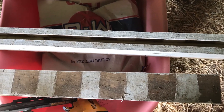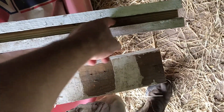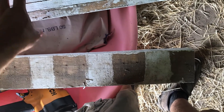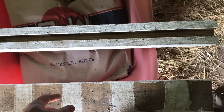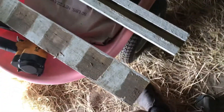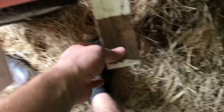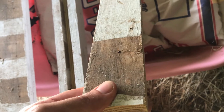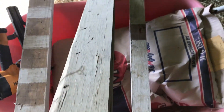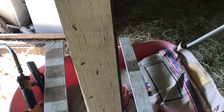We've got a linear actuator that's just gonna pick the door up and down, and the door slides in here. All this is is some scrap 1x4s — I think they're actually a true 1x4 inch. In the middle there's another one trimmed down to only about two and a half or three inches, and you sandwich that one in there, which gives you your track, your slot. Just stapled it together, and that is what our door will ride in.